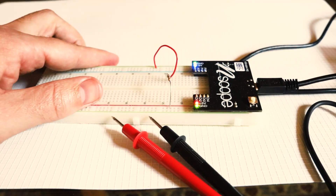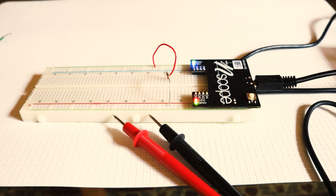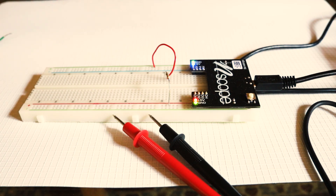So that's how to measure voltage and current in a circuit. Remember, voltage is a non-destructive measurement — you just touch the leads to the two sides of the component. But current measurements are destructive — you have to partially deconstruct the circuit, identify the two loose ends, and connect those to your meter. I hope you learned a little bit about making voltage and current measurements, and I'll talk to you next time.